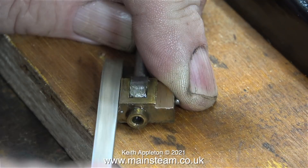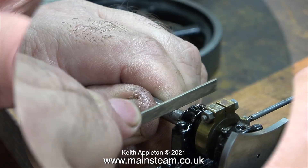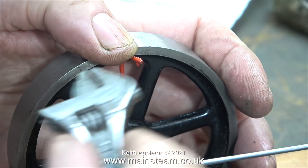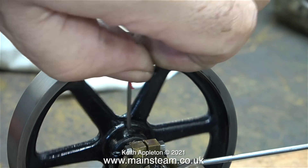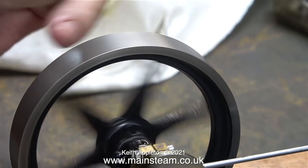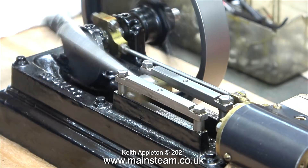All you need is a rectangular piece of metal and a micrometer, and once it's filed, check it at both ends. I found a problem with the flywheel — when I tightened the grub screw it was pushed against the main bearings. Easily rectified by the use of a small needle file. Now everything spins very freely, and when I refit the crosshead guides and tighten them up with the 7BA bolts, this is also very free and firm — just what you need.